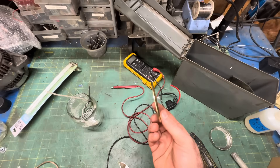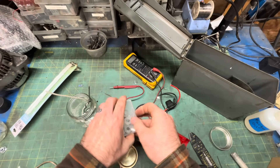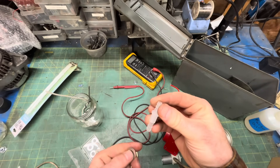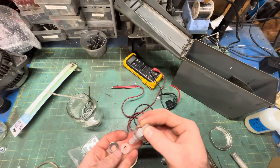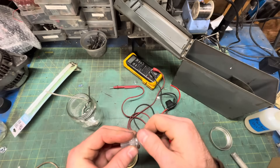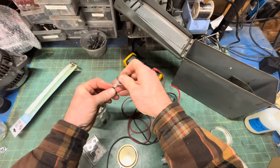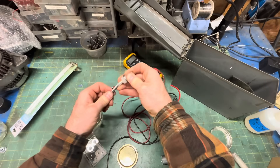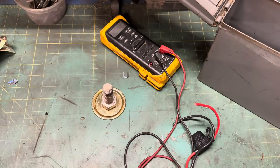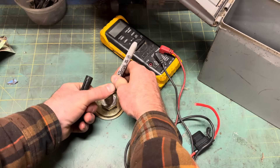We need to get power, air, and smoke through the lid. My answer: cheap nylon bulkhead fittings. All you gotta do is drill a hole in the lid, insert the fitting, put the supplied washers on either side, and tighten the nut. According to my measurements, quarter-inch fittings should pass two 14-gauge conductors perfectly. Maybe a little lube. I only like perfect equilateral triangles — all other triangles are mathematically and aesthetically inferior.